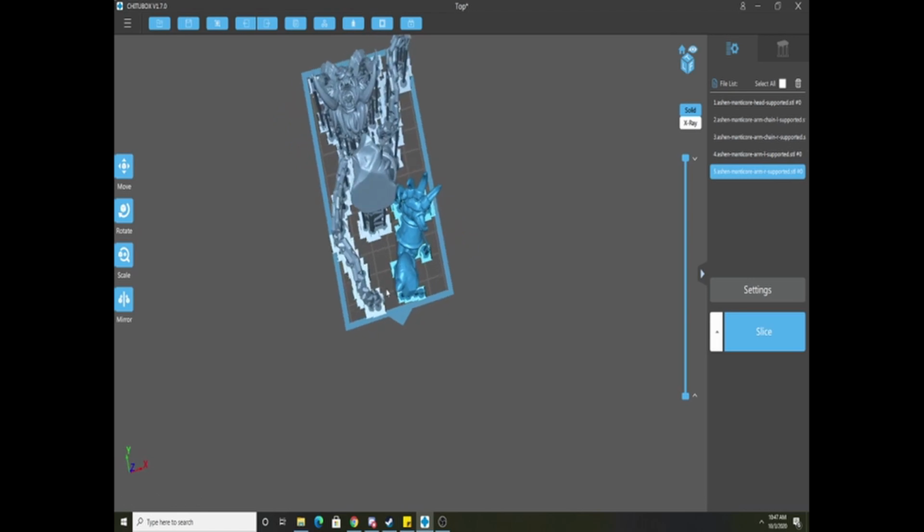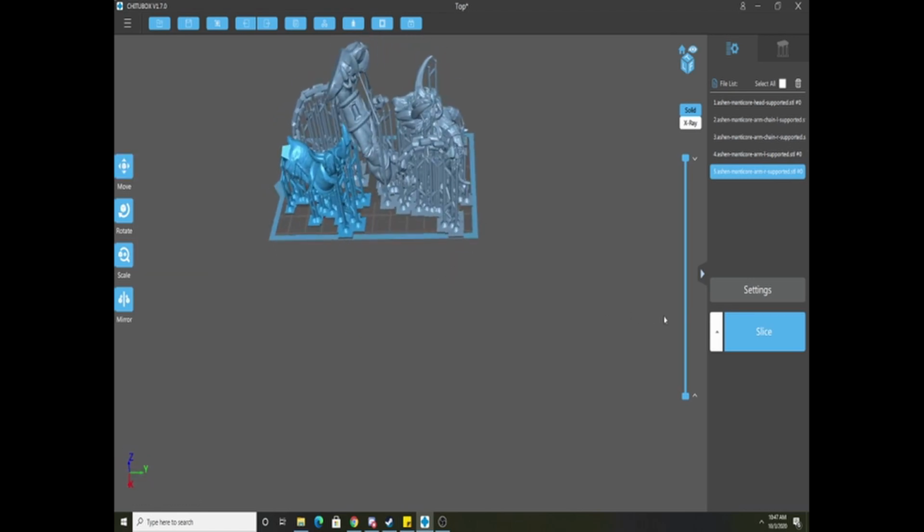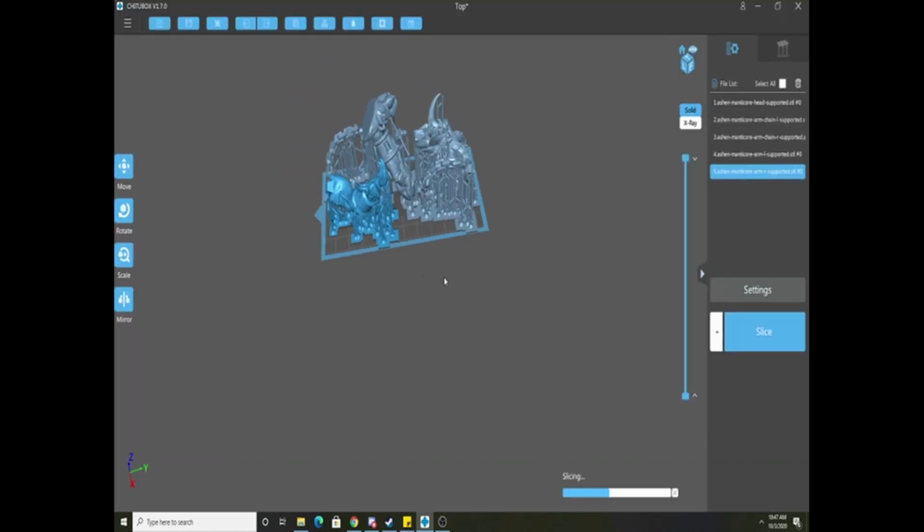So while it's printing, as you can see, it's only at 51% and it's doing its thing. The LED screen shows you exactly what you're doing. So if you take a look at this every now and then, you can see if you find any overlaps in it. I don't sit there and stare at it, but I tend to do it when I want to see what went wrong in a print. I will go ahead and redo the print, but I will fix the build plate, clean out the resin vat, make sure that everything's good, re-level it, and then go to town.